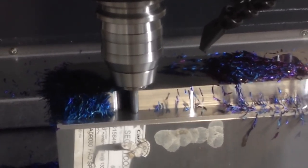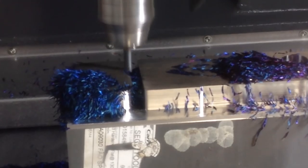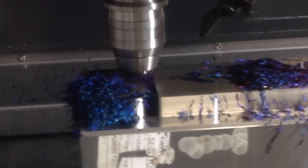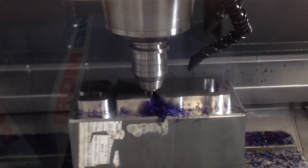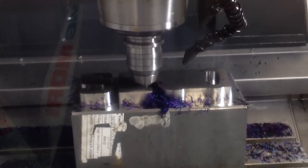It's quite small. What's the diameter of what we've got here? We've deliberately used an 8mm tool for the demonstration to show the full capability. We've used the full depth of cut of the tool — it's at 20mm deep, and we're using 20% side engagement in tool steel.